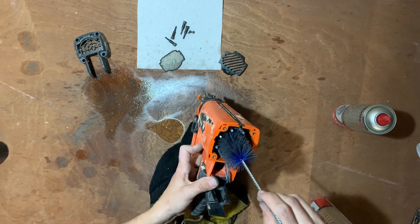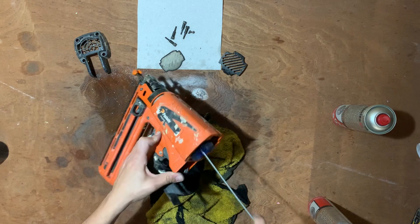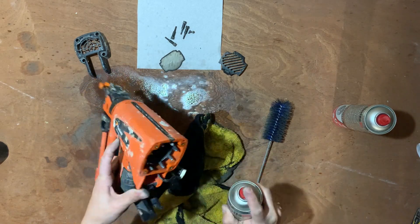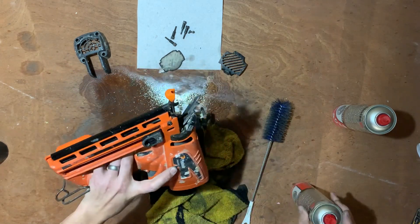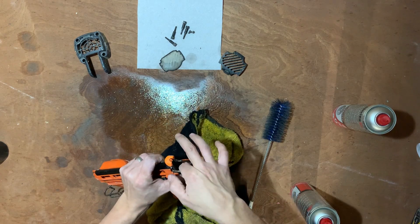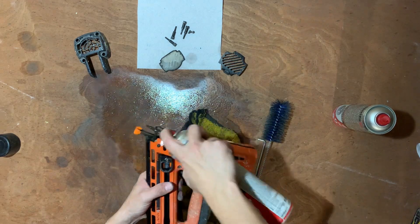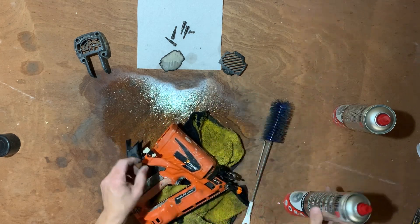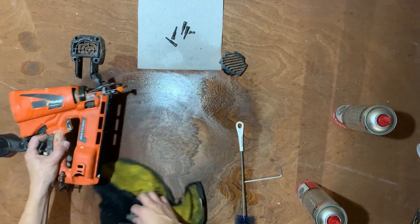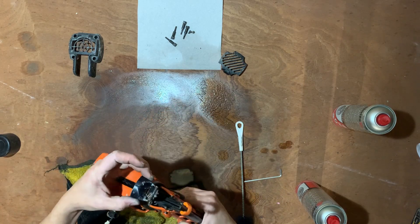And this is where I get my wire brush — push down the piston, get it clean inside, just loosen up all the gunk again. Spray. Push the pin back up to push this piston back up into position. Use the allen key to get that back up, and get rid of any residue anywhere. Just give it a spray with this. I'll say it again — avoid the cables and electric parts. So that's the gun cleaned now. We've got the inside of the gun all nice and clean, all around the bottom by the pin is cleaned of any residue.